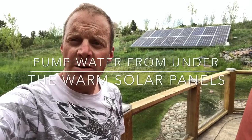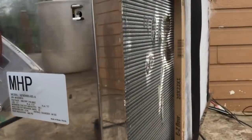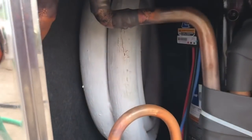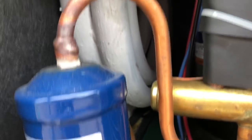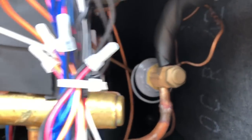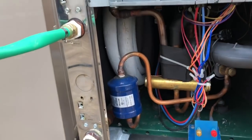We're going to hook this up out here and see what happens. There's one air coil here and inside we have a coaxial heat exchanger, exactly like I built inside, although instead of being straightened out, it's all coiled up here. The hot or cold from the compressor — which is a Copeland scroll — trades that heat with whatever water you pump in and out of this unit.